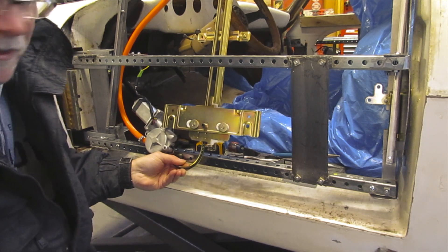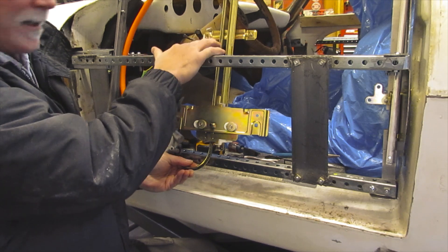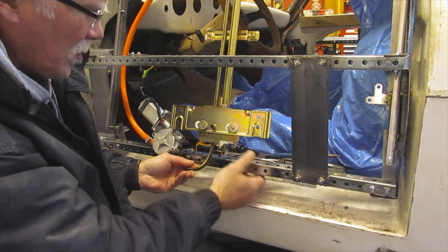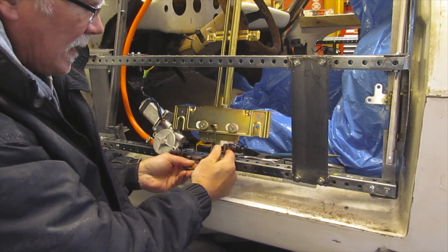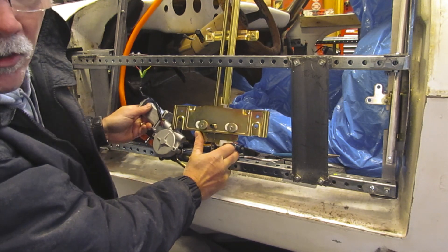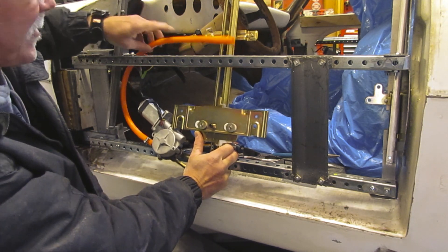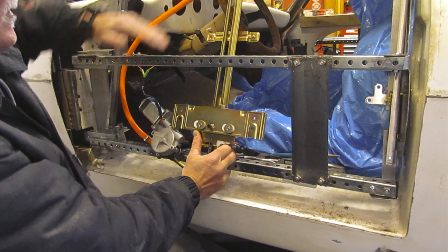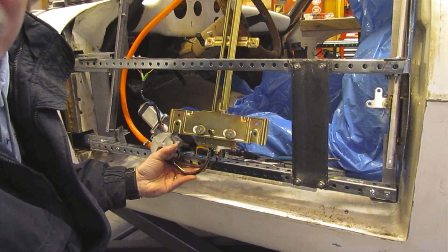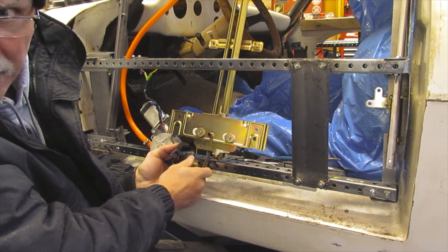This will get mounted approximately in this location. I'll make a couple of L-brackets to go against this top tube to mount here, a lower bracket to mount the bottom of the track, and a bracket to hang the motor so it doesn't just move around. Then you just leave this flex tube up inside the door when you're done — you just cut off the excess at the top to match the height of the door. The track is plenty long enough.